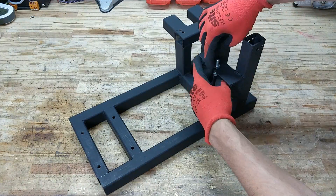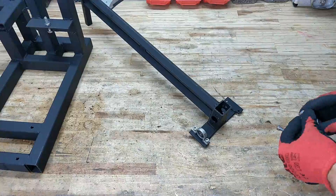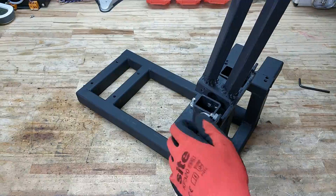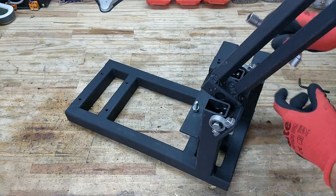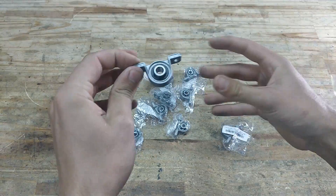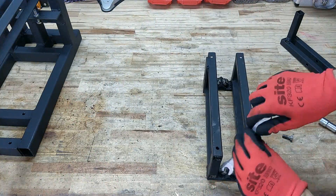This nut is used to limit how far down the blade can go — it just prevents the machine from essentially destroying itself. As for the main pivot, I went with these bearing blocks. These are great because not only can they handle massive forces, but they remove all play, which is essential for a machine like this. I got 10 of these for about 15 bucks. They need to be far apart from each other to remove as much play as possible and to increase rigidity.